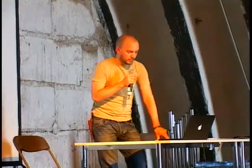So, in addition to that, we need some facilities. In most cases, we have to work in clean rooms because our structures are very small, so even dust particles in the air could seriously destroy our structures. And another thing, especially if you deal with electronics in very small structures, you have problems with heat, and that's why we use elaborate systems for cooling down our experiments. In this case, you see a refrigerator that cools basically down to almost absolute zero. So this is not necessary for all the nanoscale experiments, but whenever you shrink things down, thermal vibration, thermal noise becomes a problem.